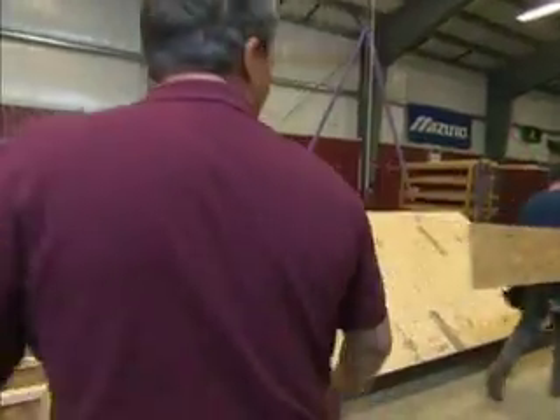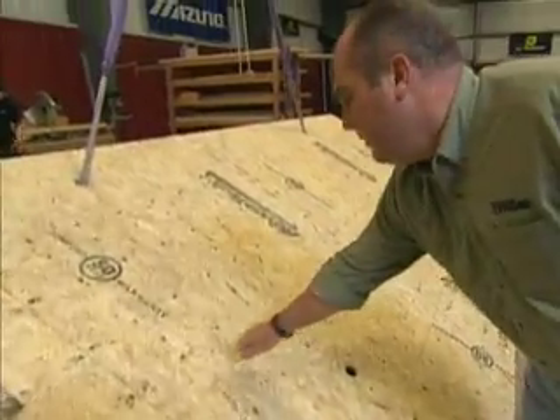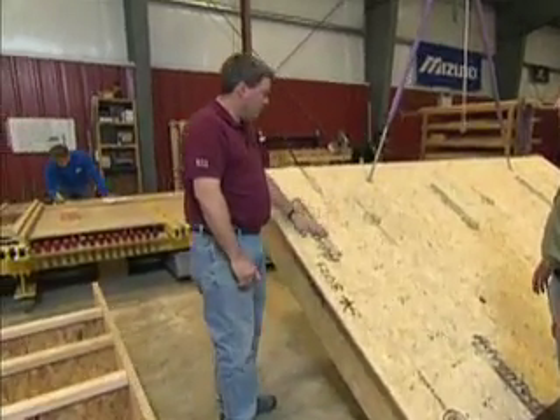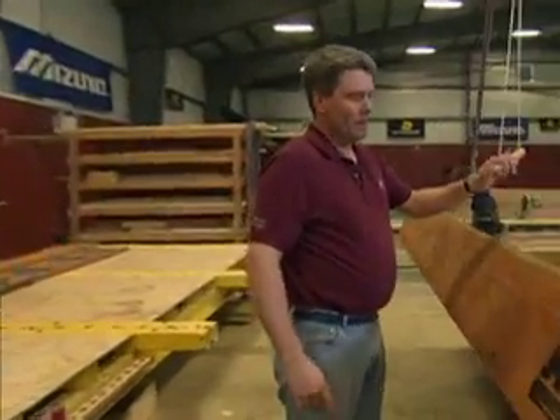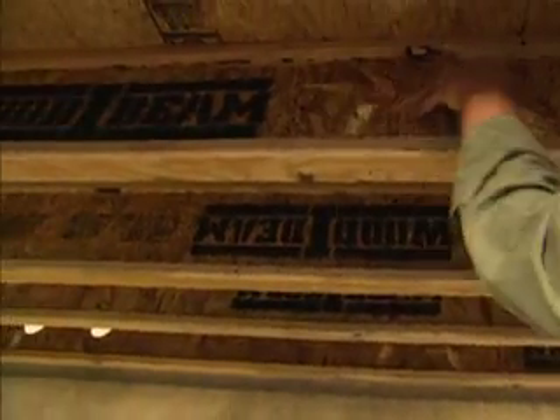This is actually your job here, Richard — this is one of our floors, the first floor mudroom. You're not using plywood, that's what we usually use. We prefer OSB — oriented strand board — it's more stable and a lot better when it gets wet on the job site, just in case it's raining the day we fly these in. This is one of the big advantages of being in a shop. You've got engineered lumber down here — these are I-joists, very strong, very stable. Compared to conventional lumber, to drill for pipes or wires we can go right inside the webbing and not affect the structure.